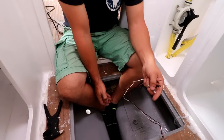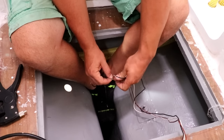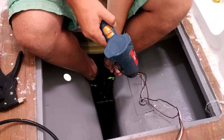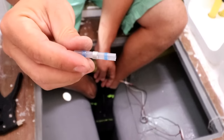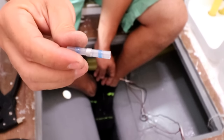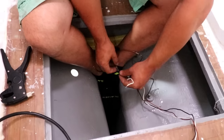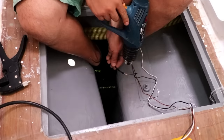Push them into one another to tie them in like that. Make sure that center lead piece melts properly — if it doesn't melt properly these things are no good. Ricky attached all of the connections and melted the solders. You just hold it still for a few seconds so that once it's cooling down you don't break the joint.